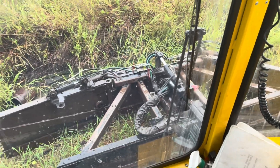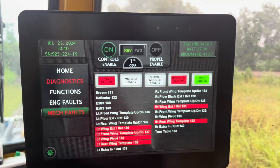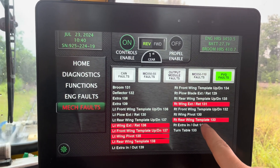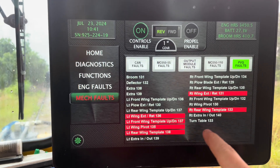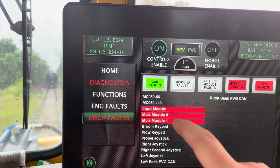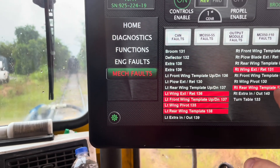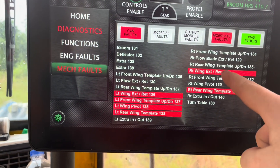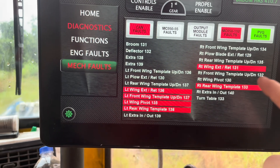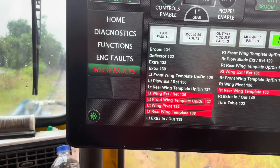This is definitely different from the last one. We have a lot of problems in this one — we even have some problems with corrosion. If I come up here and look at my fault screen, I have a lot of different faults: wing extension, rear template, and basically the whole left wing. Power sensors and all the modules. These modules are not getting any power because the CAN is open between some of these circuits, and they feed the CAN circuit out to these modules. So these are going to show faults until we get down here.